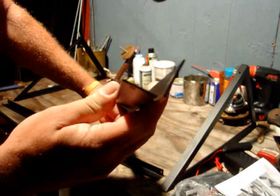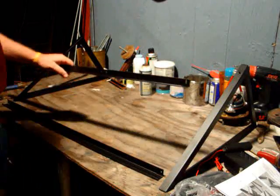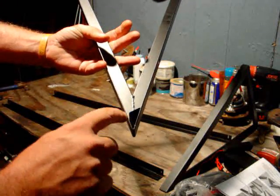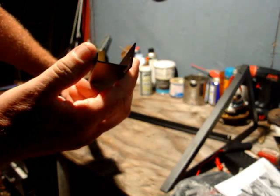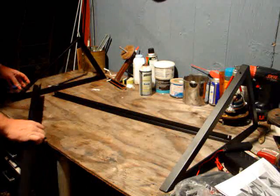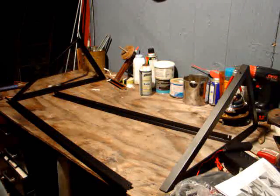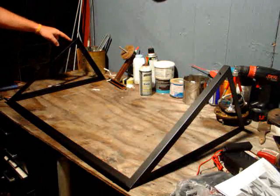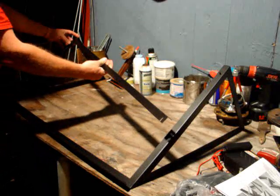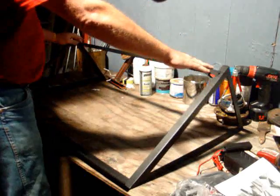Notice this piece has a slot going this way and another slot, and a hole — I guess that's for a screw, though there are no screws in this package. This one goes up on top. Right down here you see a little triangle inside with a small space. The solar panels slide down into it. This little slot right here — you take it and slide it right on down. That little triangle piece inside the framework helps stand everything up and support it. The triangle has a stud, and this piece has two studs and corresponding slots. This should slide in here onto that stud, and the same thing on the other side. The base framework support is now complete.